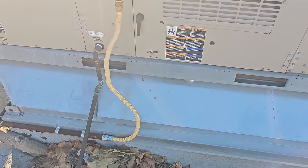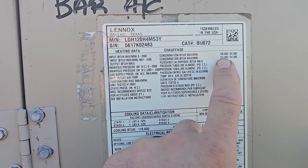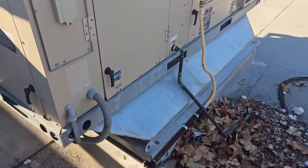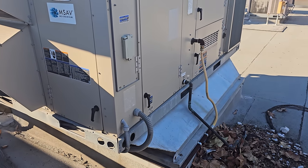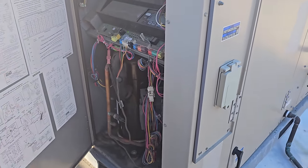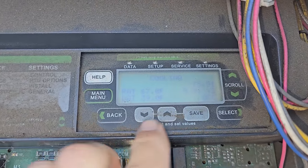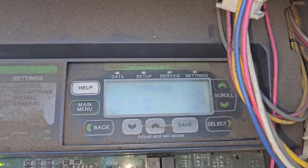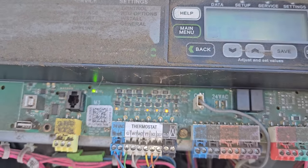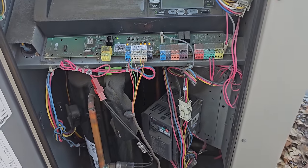I don't think that flex connector is enough to handle the 130,000 BTUs that this unit can put out — I don't think that's sized right, but we'll look into that. We're in Southern California, so our heat requirement is not that big. Up here at the board, we're calling for Y1 and Y2 — you can see via those lights, though it's kind of hard for the camera to pick up the LED lights. This unit should be running in heat, so I need to go back down to the thermostat and figure this out.